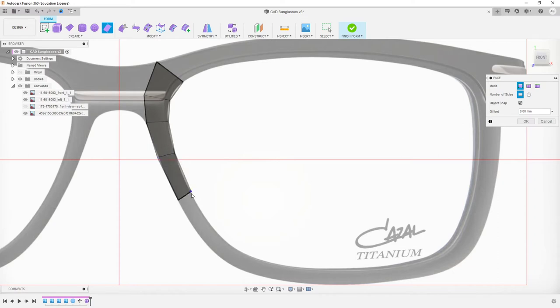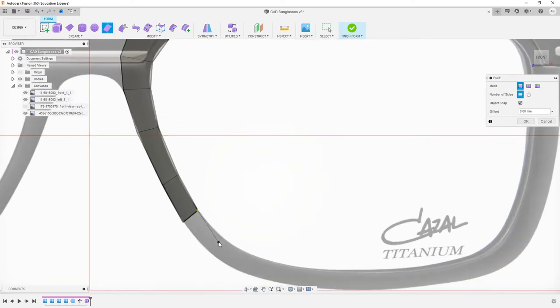Sometimes you might want to create some very short faces — if you've got a really tight radius, you might want a couple of really tight faces there. But most of the time you can get away with relatively large ones. While you're doing this, you probably just want to keep an eye out to make sure you're coming out perpendicular. So that's tangent running across the curve, and then you want to go perpendicular to that. Instead of coming straight down vertically or out more horizontally, you want all your faces to be as even as possible.